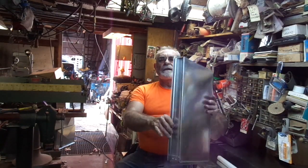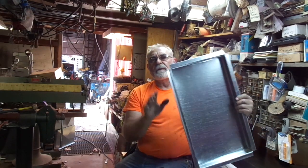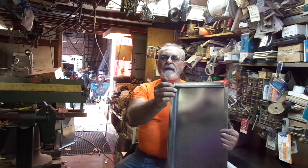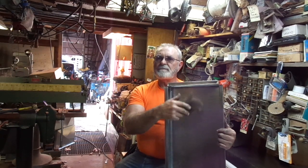I did get the fitting made that's going to attach the rear of the furnace to the return air — that funny-looking offset return air box that we made yesterday. This is just a fancy end cap. The flange surface is going to screw up against the air handler, and then I will cut this out and dovetail it.